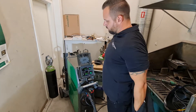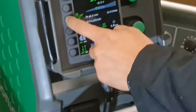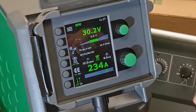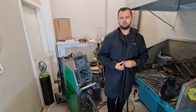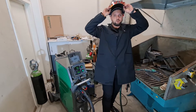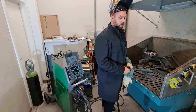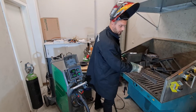So we have mild steel and we go here, we choose DC pulse and power arc pulse — done. 200 amperage, 34. Let's see what happens. The new development of this pulse is extremely good — take a look.